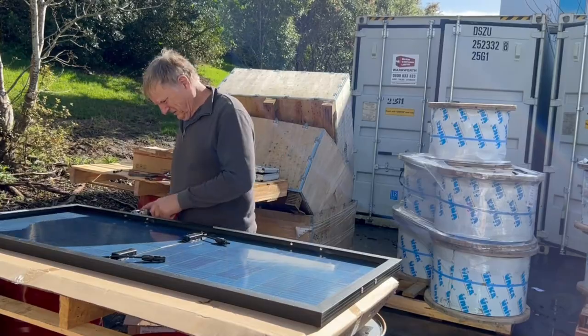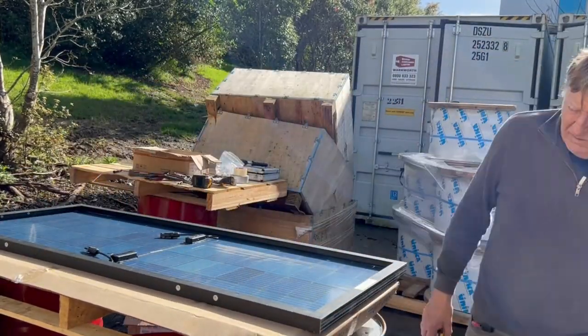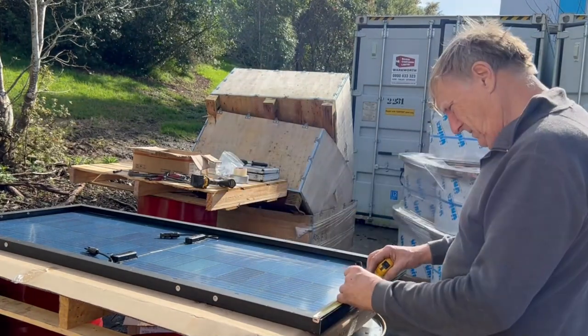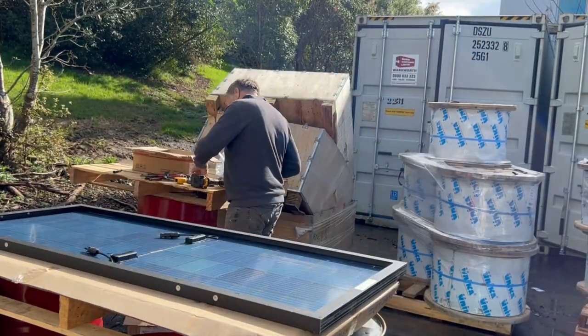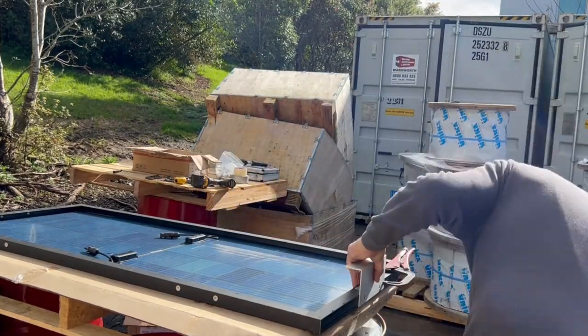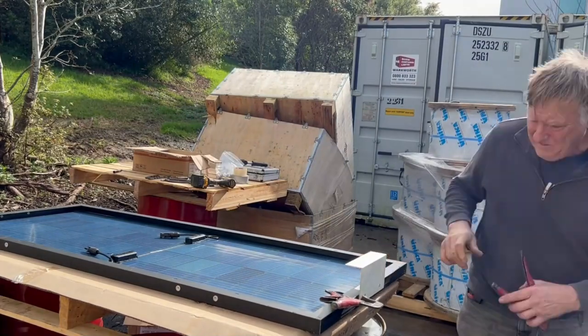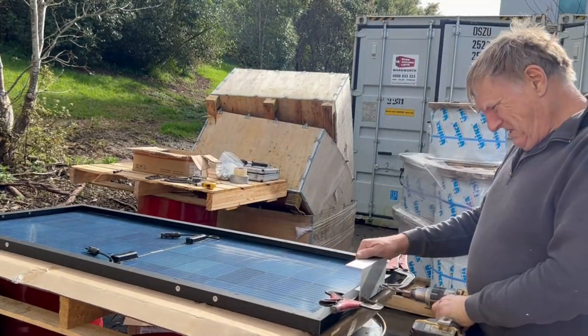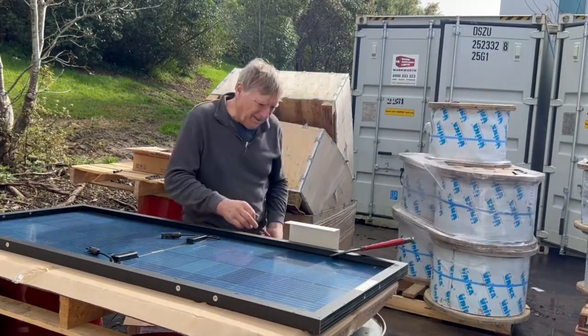This panel was designed exclusively by High Tech Solar New Zealand. We were told watt for watt this panel produces more daily output power than a standard mono or poly 280 watt panel, and I believe it does. In November 2023, we are producing power from 6:30 a.m. some mornings through to 7:30 p.m. in the afternoon. 2:30 p.m. to 3:30 p.m. is about the highest yield generally.